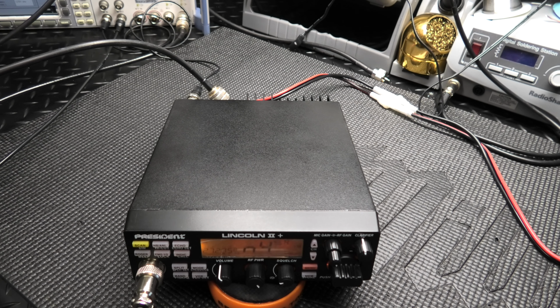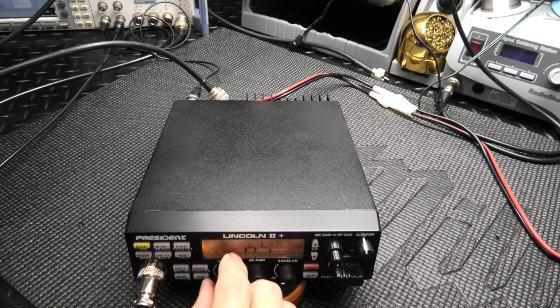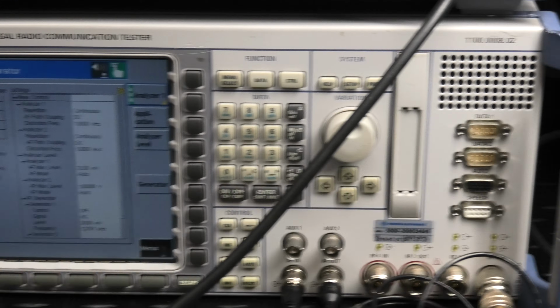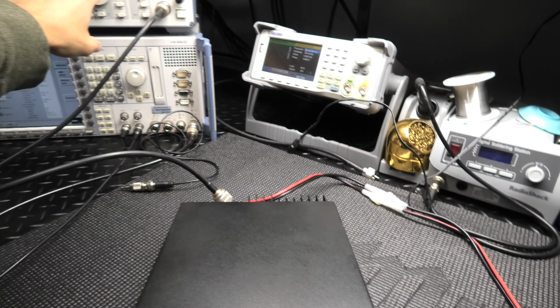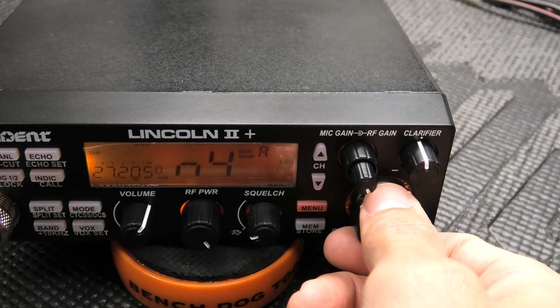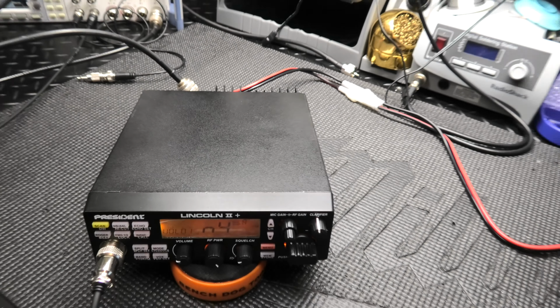Okay. And I gotta turn my volume up. Like sideband's going to be a 124 area. Okay, 124 and right there. Did you hear that? No problem. Take it down some more. There's 137. I mean, you definitely don't have sensitivity issues. So, should be all good to go, my man.